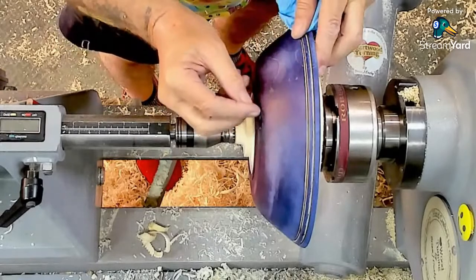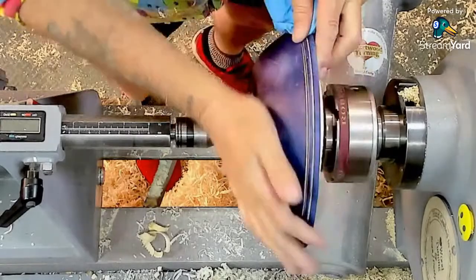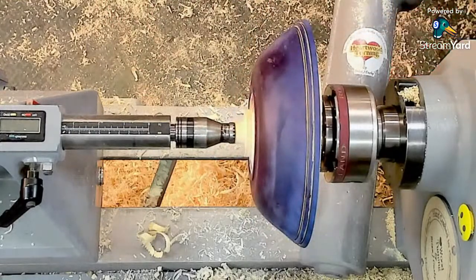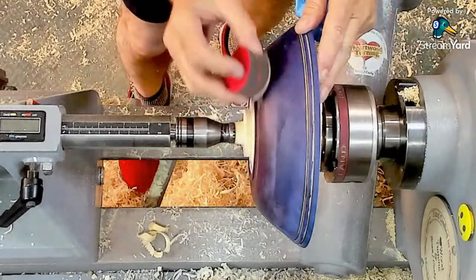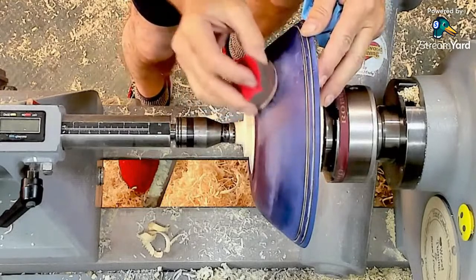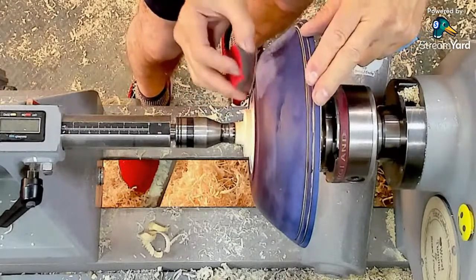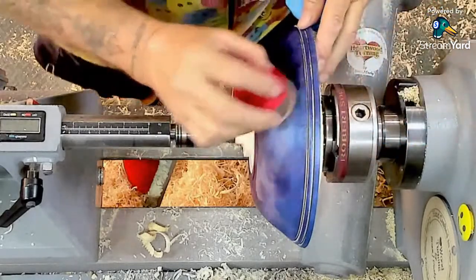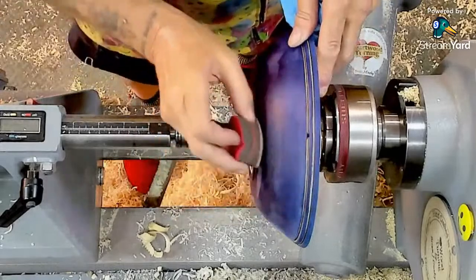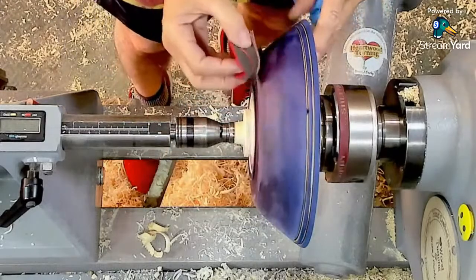I tell you what's happened here, there's just been a little bit thick of sanding sealer there. Yeah, just went a little bit hard there. Just sand it back. It's all good, eh? Just grab a quick 400 grit and give it a little rub. Yeah, a little, that's it. Just like that. And that'll get rid of it. There we go. Just a bit like doing your lacquer after you finish putting your couple of coats of lacquer on, or three I usually do. I always sand it back a little bit with 400 grit.